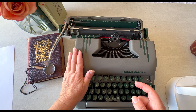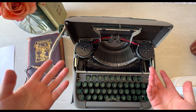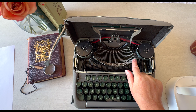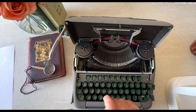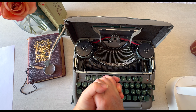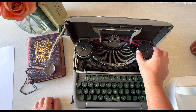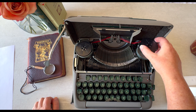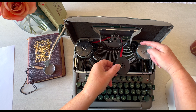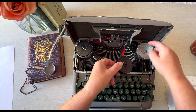I'm going to move this carriage to the left to move the handle away from the cover, then give it a gentle nudge to pull it open. Inside you'll see your typing basket — your type bars. When you press a key, that type bar folds up, pops up, and slams against that ribbon to impress a letter onto your paper. Here's your spool — this takes a universal ribbon, and you just pop them out like so.